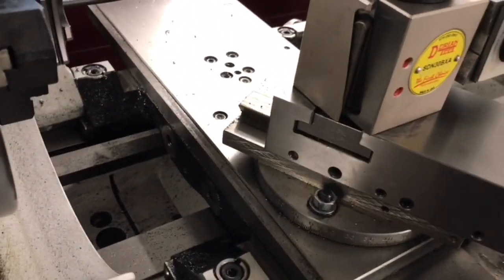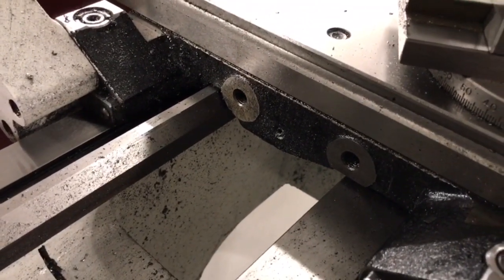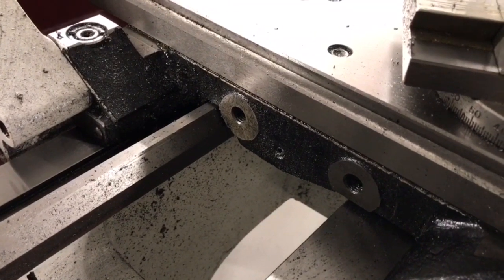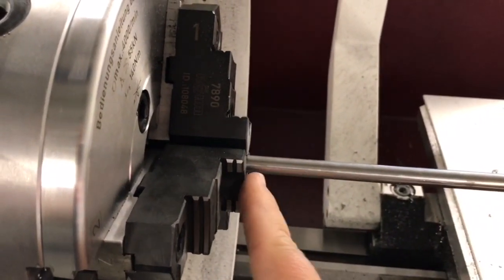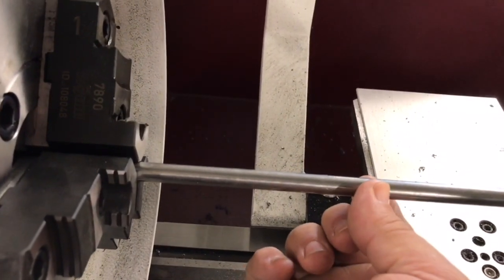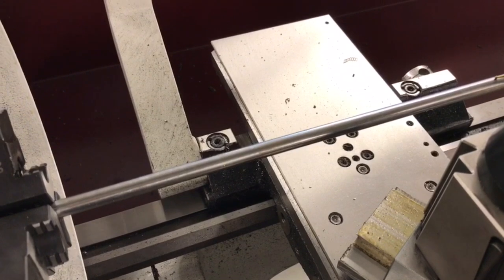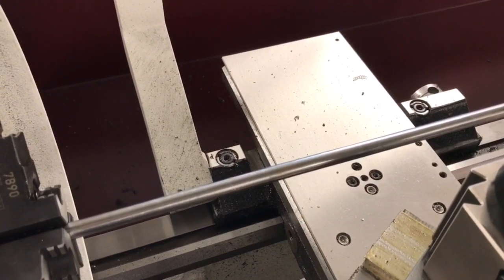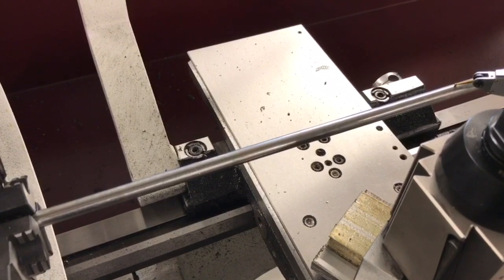How it works is every lathe has these two holes right here — these two holes are threaded. You'll have to figure out what size they are. In this case they were metric, 10 millimeter. Once you figure out the size, you can use these holes to bolt a plate up here. The plate can then be drilled and reamed to size using the drill held in the lathe chuck itself. You're going to ream it to size so the stock passes through. In this case I'm going to use an oversized 376 reamer. That's going to allow me to support this during threading. It does have a limitation — I can't turn with this because the diameter can't be changed unlike with a follower rest, but it would allow me to do this a lot better and easier.